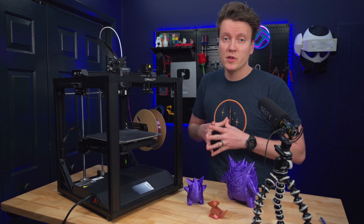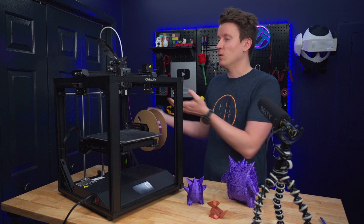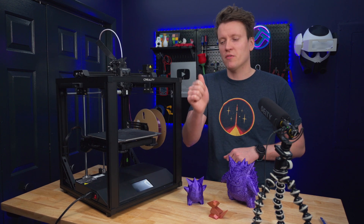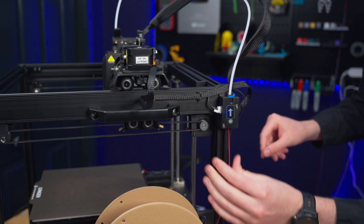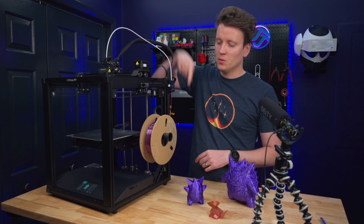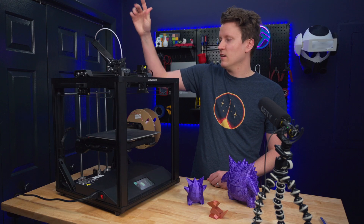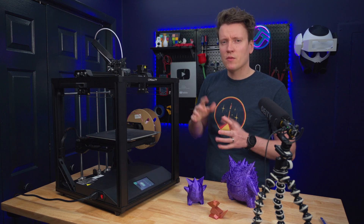When it comes to the specs of this printer, it's pretty normal in a lot of ways — it just comes with this box frame that makes it more stable. When it comes to usability, there's a full-size SD card on this side, which I do like. A lot of printers use micro SD cards which can be a little more fiddly. The filament loads up through this filament run-out detector. This is called a reverse Bowden tube when it's a direct drive, but you still have this Bowden tube feeding over to the spool. It's a weird design on top that doesn't hold onto the Bowden tube very well, so it just slides out really easily.